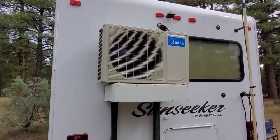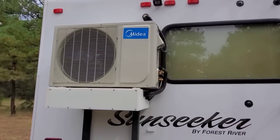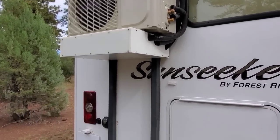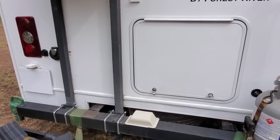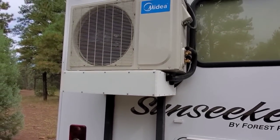And once the temperature reaches the set point, the wattage goes down even more because it only has to maintain that temperature rather than using more power to reach the temperature. This is because the AC compressor has several speeds, and the farther the temperature is from the set point, the higher the speed that the compressor must operate.